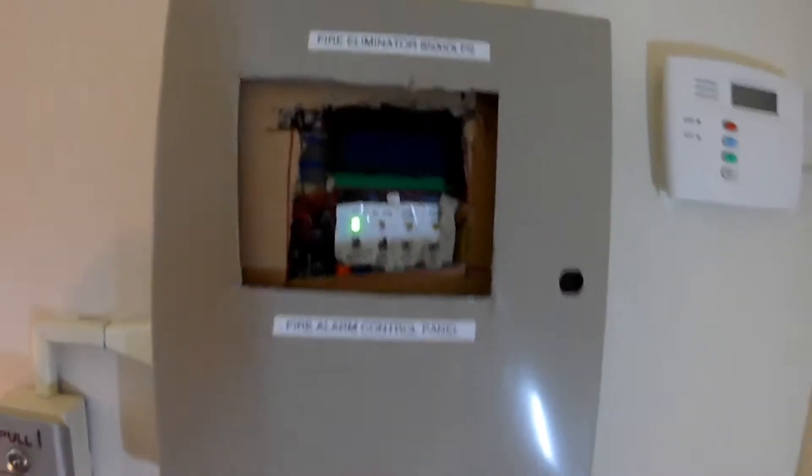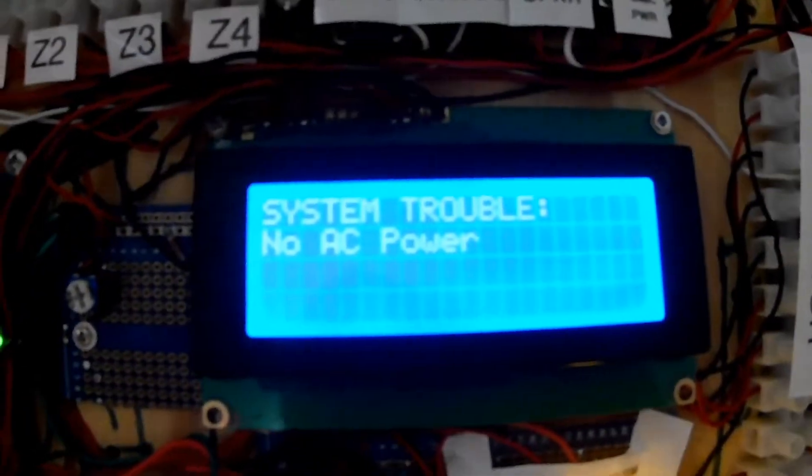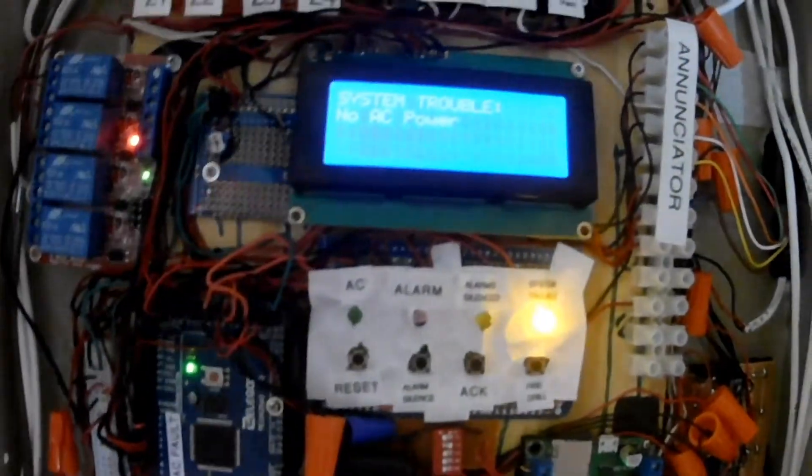So you can see the junction box — power junction box here. I added some wire mold conduit here; this can't be covered because of the programming cable for the panel. Here's the panel right here. As you can see, it's totally different — it has the 20x4 LCD. You can see it's very different. It's got the indicators here and an acknowledge button, because now this has power supervision through the provision. So basically, if I get this power spread right down here, the relay that monitors the power will tell that the other system is in trouble because we lost AC power.